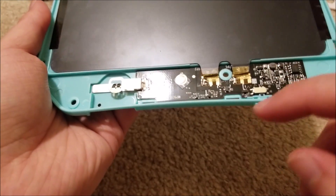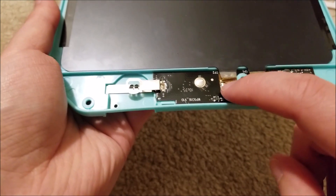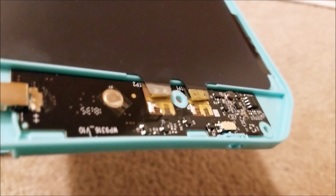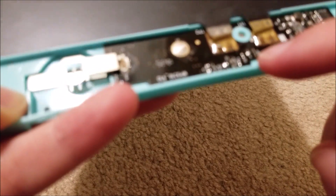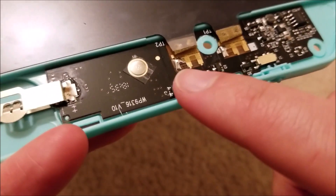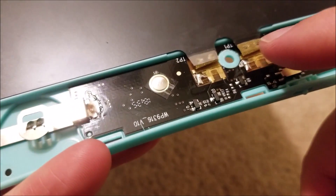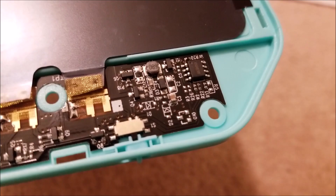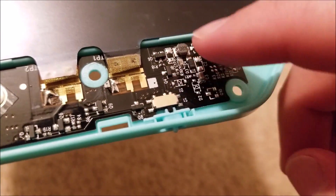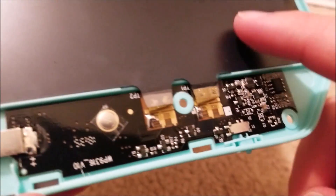Here's the switch — likely in series with the battery. Here's the actual button itself with solder pads. It looks like they're using conductive mesh to connect the plastic parts, since you can't solder to plastic. I can see some transistors in here, and what looks like a discrete H-bridge with four transistors. They're likely flipping polarity — similar to how E-ink works — to erase everything. There's also a tiny inductor and a diode, so there's some kind of switch-mode supply to step up the 3 volts from the battery, probably to around 5 or 10 volts needed to erase.